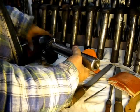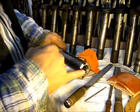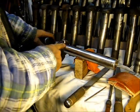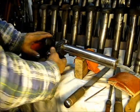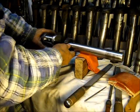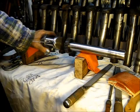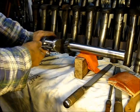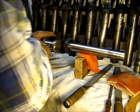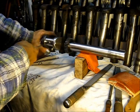One of the things I found is that down in this hole here, there is actually another hole down here, and then it goes on down, and there's another smaller hole. What that is — your greaser goes here, you turn it, the grease comes in, and then it comes out of this hole right here. This was one of International's bright ideas: how to grease the bearing on the center of the crankshaft.